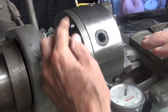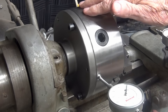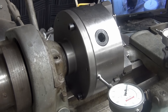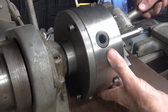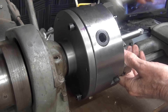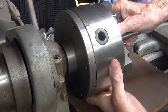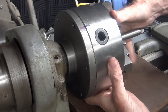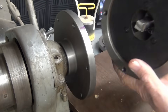Now I'm going to take the indicator off, remove the screws, and tap the chuck until it comes off. But I will put an index mark on here because I want to put it back together the same way. These are backed way off — let's see if it comes loose. Quite easily, actually. Don't smash your fingers. The screws are out and I do not feel any movement — I'm not able to nudge it one way or the other. So off it comes.